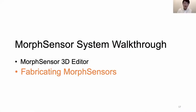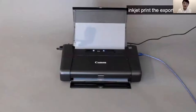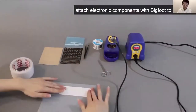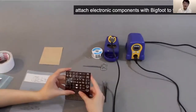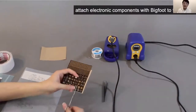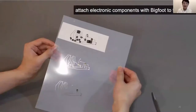Let's look at how we fabricate the MorphSensor. We developed a rapid fabrication technique based on circuit stickers and extended with prefabricated PCB footprints — the BigFoot — which are essentially slightly bigger SMT footprints for better connection. We first inkjet-print the exported circuit, put down some double-sided tape on the back for later object attachment, take out the BigFoot, and solder the corresponding components onto it. Then we attach ECAT tape to the back of the BigFoot, which is conductive only through the Z-axis. We attach the components to the circuit, and there you have the fabricated MorphSensor.